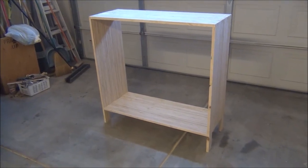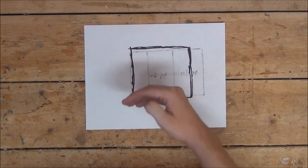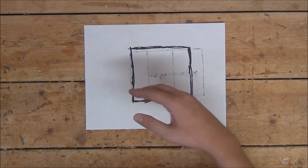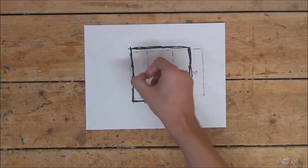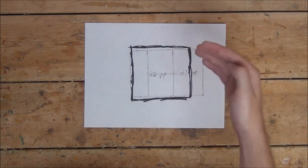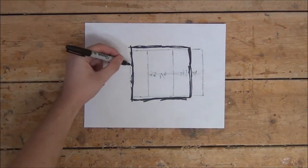Now it's time to start cutting channels. We're going to want to take our router and begin to cut channels into the side of the cabinet for the shelves to be able to slide in. We're going to want the channels to be about ¾ inches thick and about a quarter inch deep. After dividing the inside of the cabinet by three, it looks like we're going to want to put a shelf about every 8½ inches.